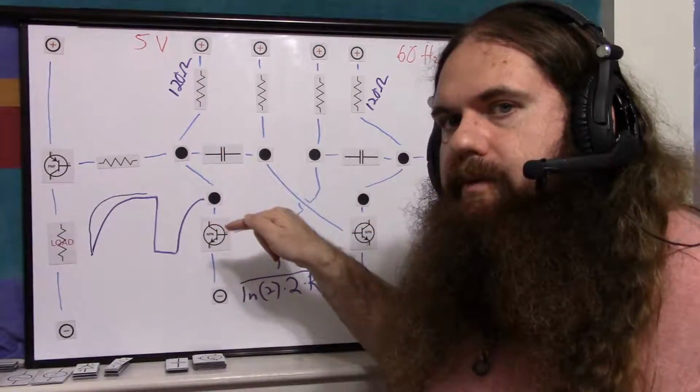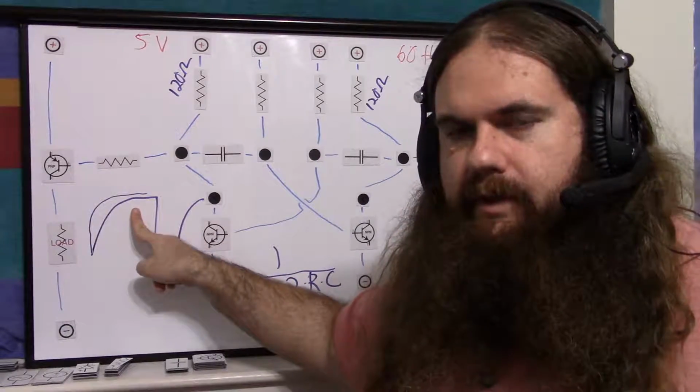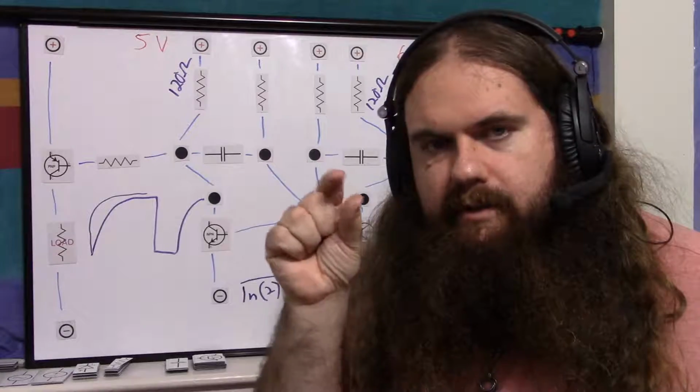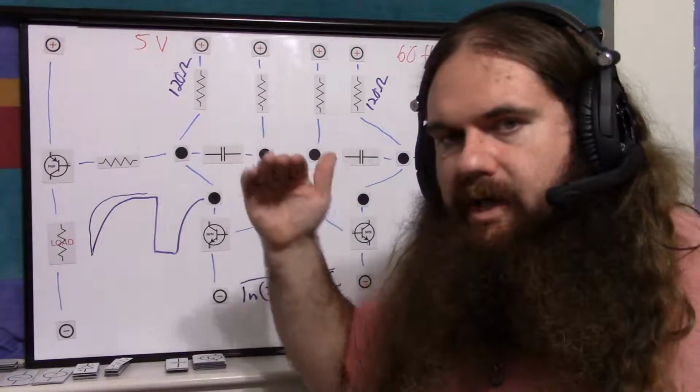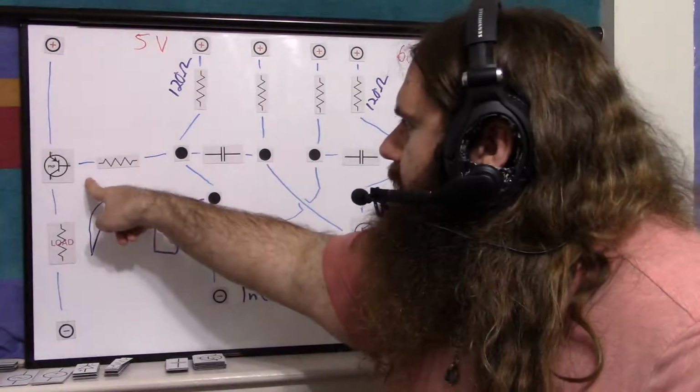So the bottom of the load is connected to zero, the top is connected to power. So this is the bottom of the load. When the bottom of the load is high and the top of the load is high, that's a voltage of roughly zero across it. That's why the load is off. Voltage is a difference. So if the top is always connected high, you have to connect the bottom low to turn the load on. And that works the same way here.